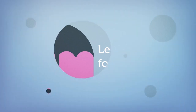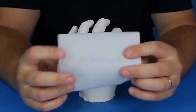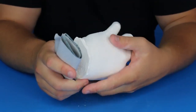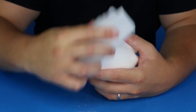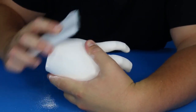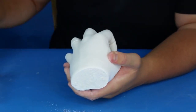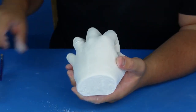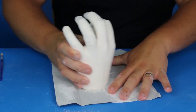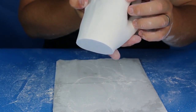Now it's ready to make the finishing touches to your casting — here's a different casting I made earlier. Included in the kit was some sandpaper and I'm going to use this to tidy up the base of the casting. This is completely optional — some people prefer the rustic look of a natural base, but my preference is to flatten the base and bevel the edges ever so slightly. In a well-ventilated area, take your sandpaper and lightly bevel the bottom corner of the stone casting. Be really careful as any thin flakes of plaster will be very brittle and can take a larger chunk of stone than you might expect. Then lay the base flat onto the sandpaper and gently move the casting back and forth in a slight circular motion, allowing the weight of the casting to do all the work — not pressing downwards at all. Once you've done that, the base becomes nice and smooth.